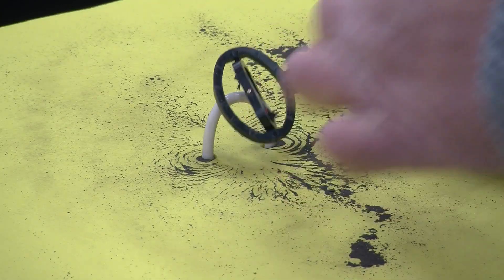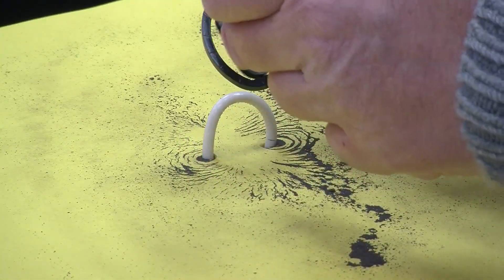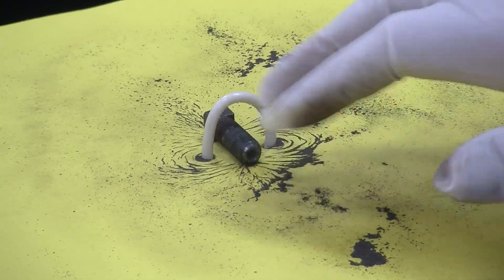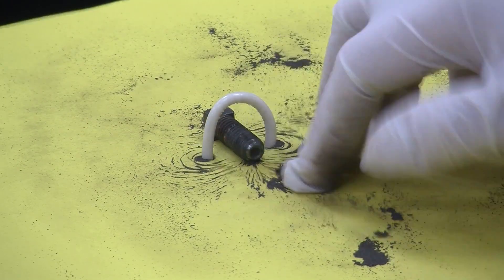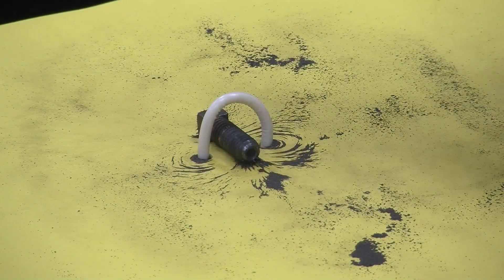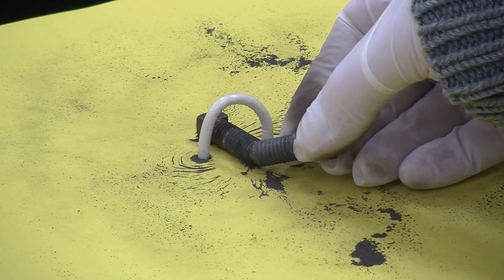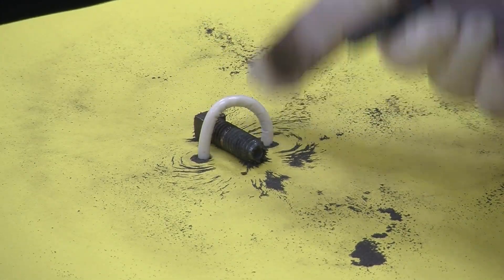I should point out this thing has a little magnet in it to do the magnetic field detection, so when it was lifting up the bolt, it was this magnet that was doing the lifting. Once again, you can certainly see the field is emanating from the ends of the bolt — this bolt has become quite a nice little magnet. Unfortunately, with one loop of wire, we actually need quite a current to get any useful amount of magnetism. In fact, this is carrying about 100 amps right now and it's already getting too hot, so I'm going to turn it off.